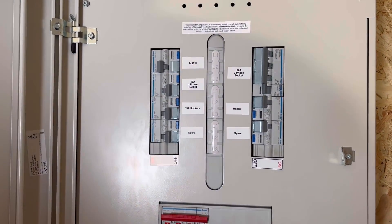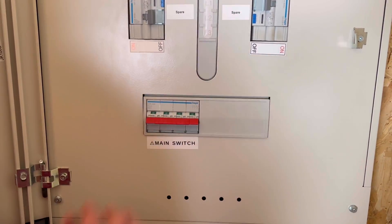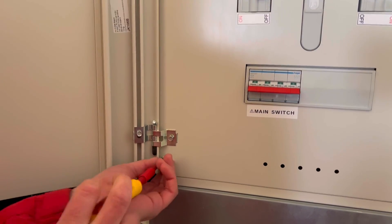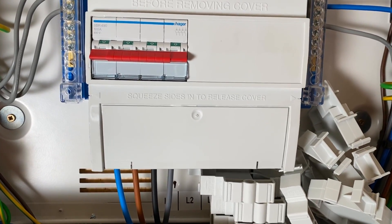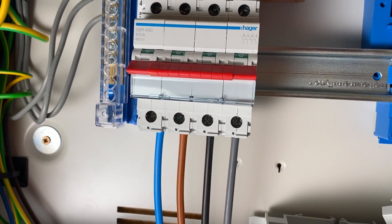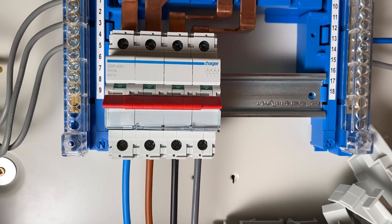Even though I've seen the lighting circuit go off, I'm still going to presume that this distribution board could still be live, so I'm going to knock off the lights and the main switch. In the event of taking this cover off and it still being live, it will only be the terminals in the bottom of that main switch that would actually be live — and that's the point at which you would start to prove your safe isolation procedure. Remember those links are in the description.